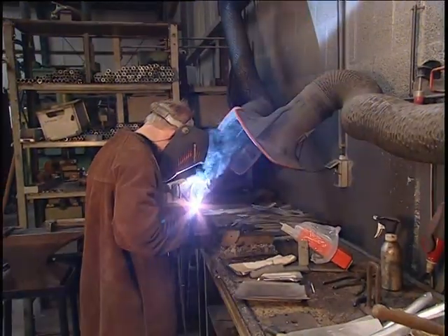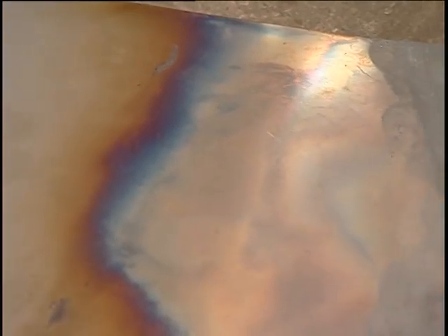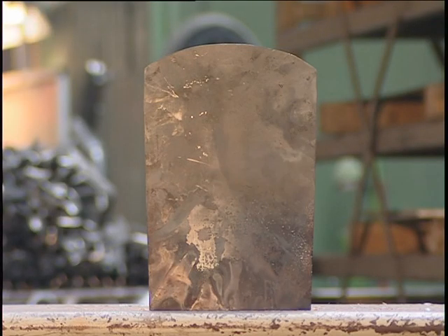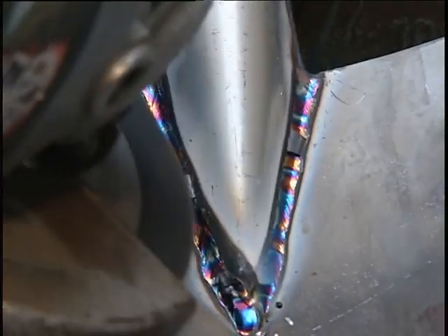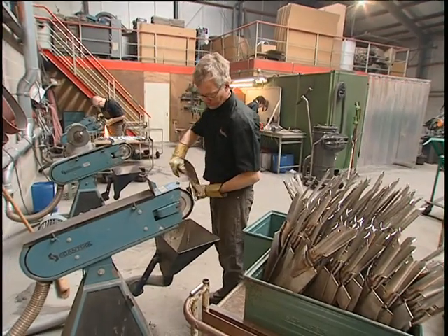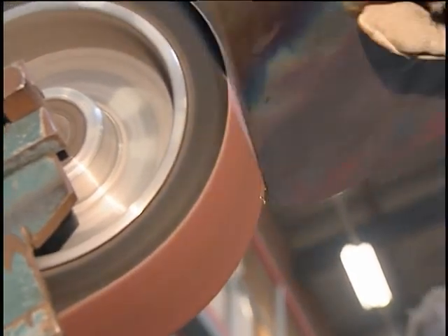The socket has a useful hole where the handle will be attached later. All of the work has left the blades a little dirty, so they're rinsed in soap and sent to an ultrasound bath, where sound waves shake loose any unwanted dirt. The new shovel blade then gets some cosmetic work — here it's being sharpened, which will save the gardener some effort when working in tough soil.